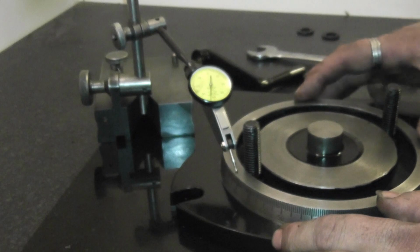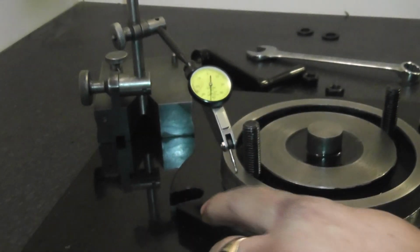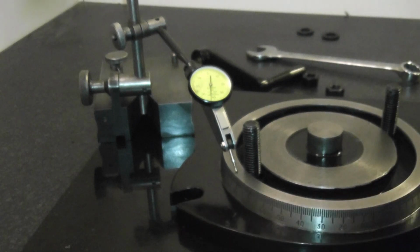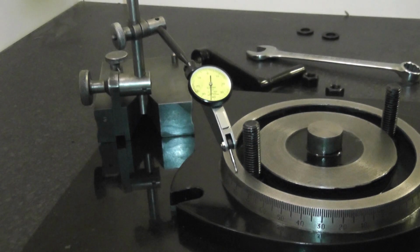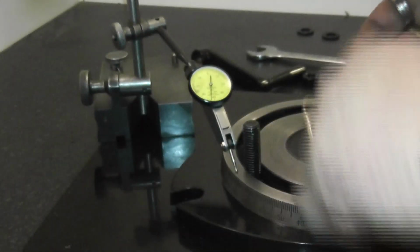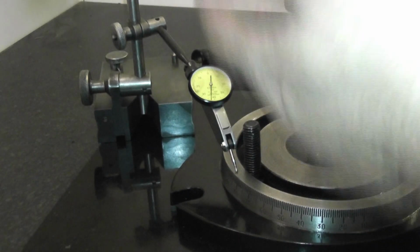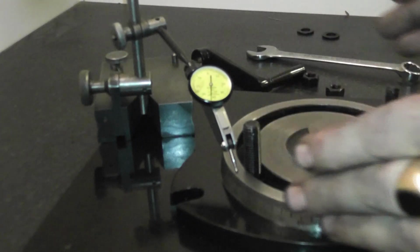Now with that quarter, or maybe a third, something like that being high, maybe there's flex in the cast iron. And the reason why is when you bolt these down, maybe when I bolt that down it's going to pull that quarter down. I mean, it's only 0.08 of a millimetre, so I can hope basically that when I bolt that down, it's fine. I've got no dye or anything. Tony tested a vice and used some blue paste, I can't remember what it's called now. He just wiped it all over the surface plate and then ran the part over it, turned it upside down. You can see where the actual contact is of that base to the dye, and any section of it that hasn't got dye on it hasn't been in contact with the plate, so it's high, so when you bolt it, that section is going to pull down. And I think more than likely in that corner underneath there'd be a light patch, but I haven't got any of that dye. So anyway, that's that section.